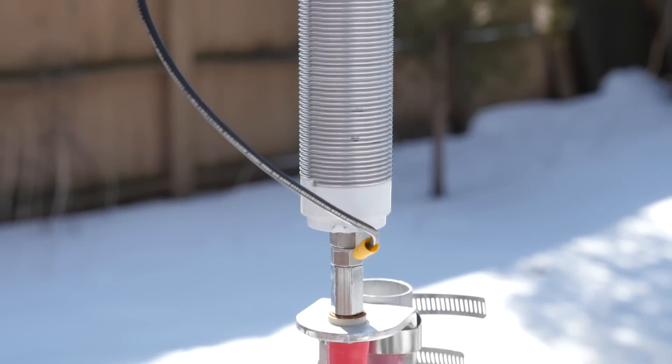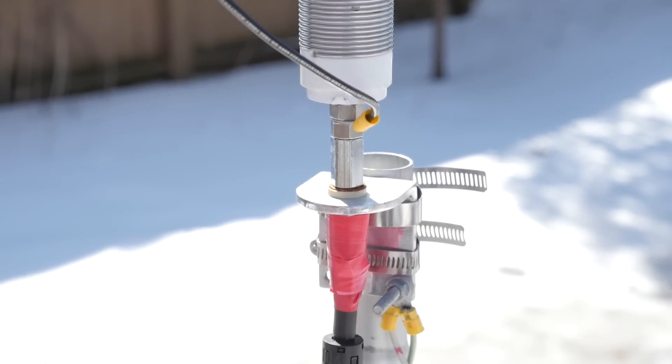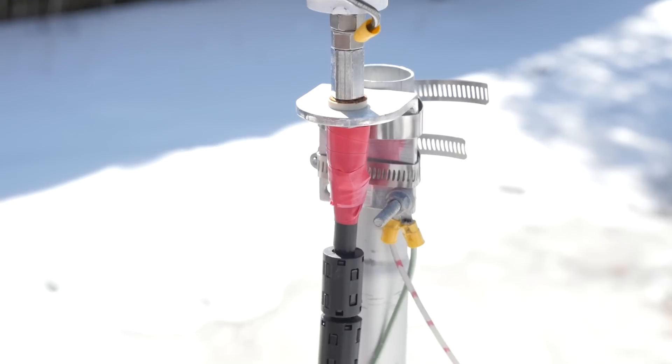There's a plastic screw you can use to tighten the coupler, but in reality it's not going to go anywhere unless you're in a mobile setup. The coils are designed for mobile, portable, and base use. They have a 3/8 by 24 screw on each end so you can screw the coil into a mobile mount with a 3/8 by 24 female socket. The 1000 weighs about 1.8 pounds, so you'll need a pretty rugged mount for mobile use. The Mini, which will get you down to 40 meters, is about half that weight.